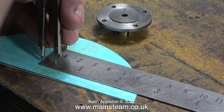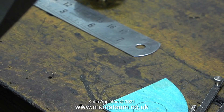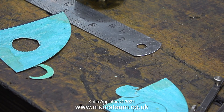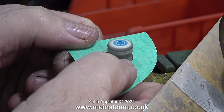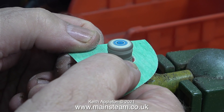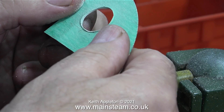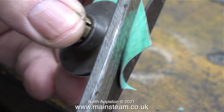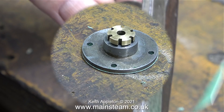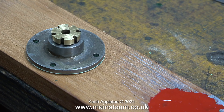I'm using my small drawing compass set to describe a three-quarters-of-an-inch diameter circle. I'm making the bottom gaskets — I've cut the material in half as it's much easier to work with smaller pieces, and here I'm carefully cutting out the centre. I'm purposely on the inside of the line because I get it to the finished size using a flapper wheel fitted in my bench-mounted Proxxon motor tool. Using this method I can make gaskets that are really accurate, though they do burr over and I have to clean that off with Scotch-Brite. Once the gasket fitted on the three-quarters-of-an-inch register on the bottom cylinder cover, I cut round it with scissors and ended up with a perfect gasket.